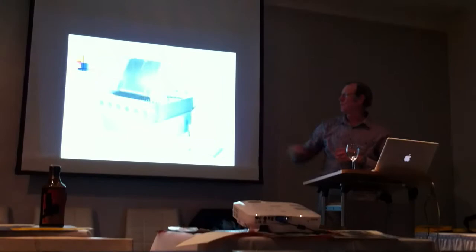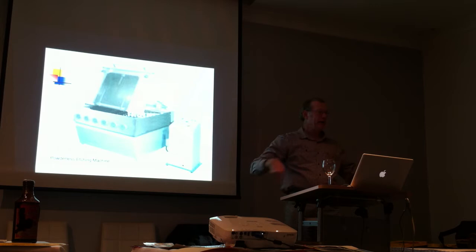How they essentially worked, you clip the plate on the lid, close the lid, and the paddles inside it threw a solution of acid and water up, but it also had an emulsified oil in it. Now, what this oil did, I don't know how they invented it, but have you ever tried to degrease a path or something smooth, and you squirt it with a hose, and the oil rings run off, but they'll pick up on anything protruding, sitting up, and they're very hard to get off. So the flat areas, it comes off, but it picks up on any raised bits around.